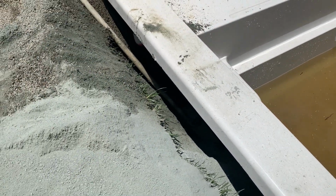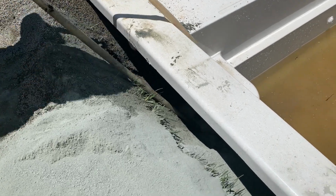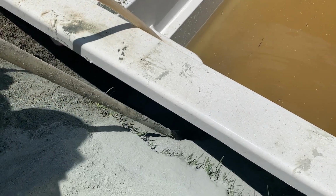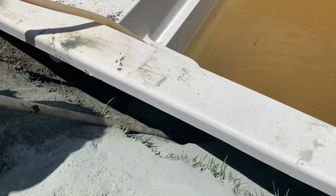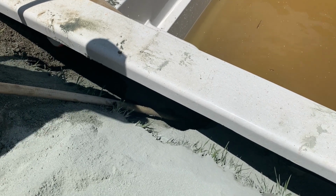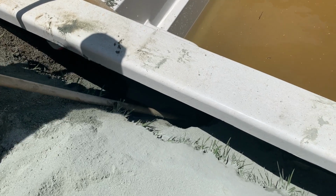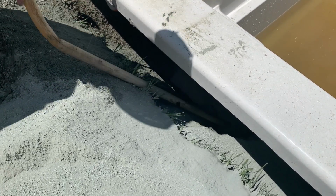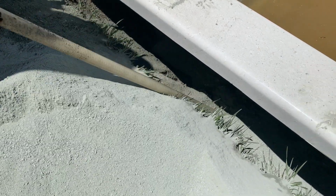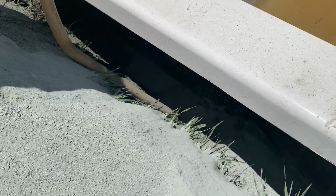You're continually checking the amount of water that's around your pool using the standpipe. Following that stage, you fill the pool up another 300 mm and backfill up to that level, and then you get up to the level where it's pretty much fully backfilled in and around the pool, and you're getting ready for the bond beam. If you live in pretty much everywhere in Australia except for WA, where you need a concrete bond beam that goes in and around the pool. That's a topic for another discussion or another day.